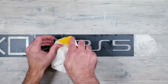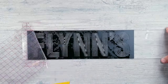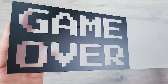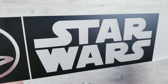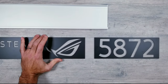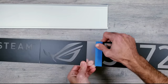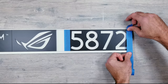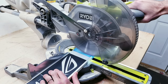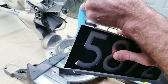I'll be doing the same thing with all the other cutouts. That's a very random collection of images, and I'm going to cut these down to create individual sizes to fit each cutout. I recommend wrapping the acrylic with some painter's tape to help avoid chipping, and when you slide it into the aluminum profile tape things down so everything is secure. I was a little nervous because I had no idea how this would turn out, but I'm happy to report that these cut flawlessly using my miter saw. The cuts were super clean with no visible chip-out of the acrylic or tearing of the vinyl.